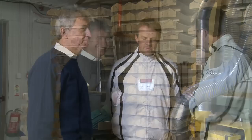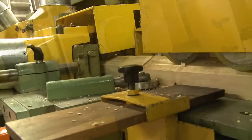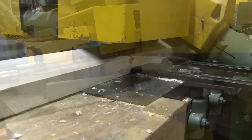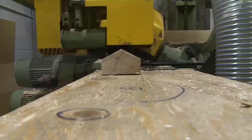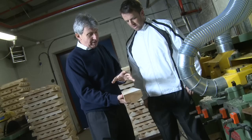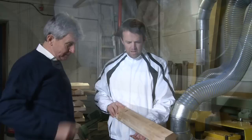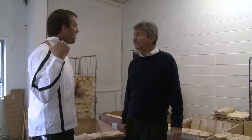So we've come in from the dehumidifier straight into this machine here. This is called the molder. The purpose of this is to take the cleft — the blade — out of the dehumidifier and make it into a consistent shape, so when it goes to machining it starts at exactly the right place and gives the right shape. When it's been through the dehumidifier it's quite rough and you can't see the grain that well. After the molder it's much more consistent in shape, and as you can see, the grains are much easier to see. It starts to look a lot more like an actual cricket bat now.